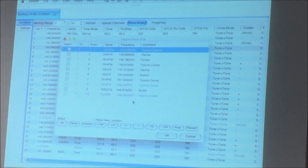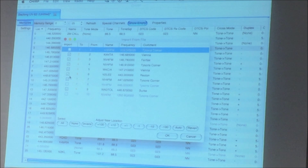It will say here's how you want to program these frequencies. What I normally do is come over here and figure out which ones look good. You'll notice this first one doesn't let you check it for some reason. Some of these, like number 10, are totally not in the frequency range of your radio — this is a 2 meter or 70 centimeter band radio, so it's never going to use a 1200 megahertz repeater. But you can do Select All and then Auto them.